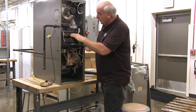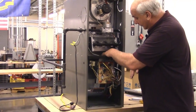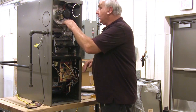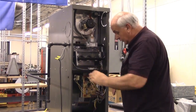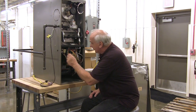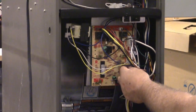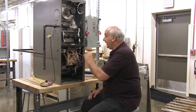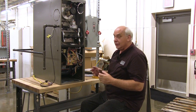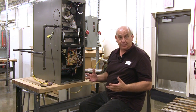This furnace is fairly new. The burners are clean. All the wiring looks good. We always want to check for wiring that might have been pinched or cut, or have loose ends. Come down here again to the bottom and just check to make sure all the wiring connections are secure. We unplugged the electricity so it's safe to touch all this. Now that we have checked all that, we have basically done all the important things — what we call preventative maintenance — to ensure that the furnace should work throughout the winter without any problems.